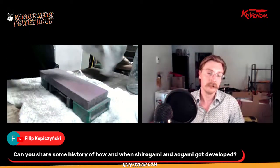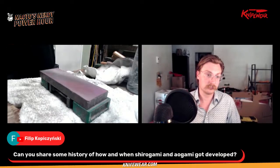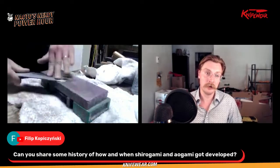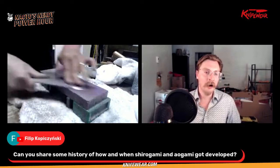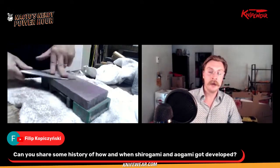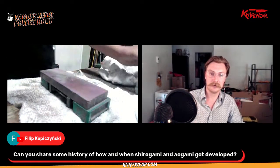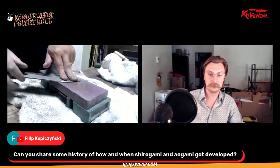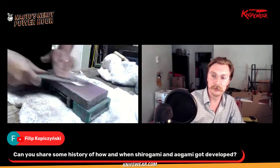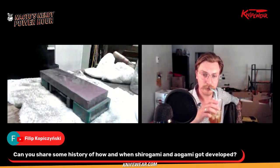Basically, what happens with oil quenching is that when you quench in oil, the steel cools slower. Even if the steel cools slower, it still gets the same hardness. That's the quenchability. And the result is it adds another layer of toughness and a little bit of carbide. And does cooling slower help with the conversion of carbides more thoroughly? Well, yes, it can. There could be more so-called free floating carbons kicking around. But basically, the chromium element itself becomes a carbide with the carbon, right?